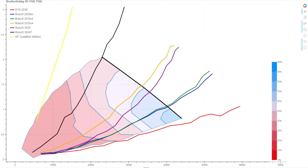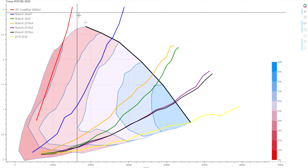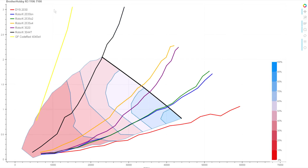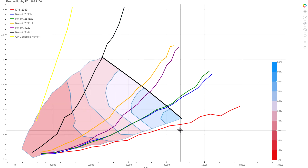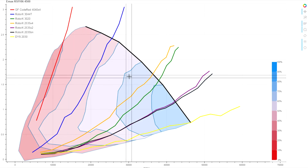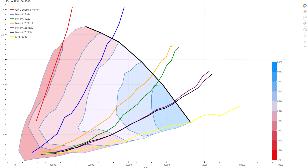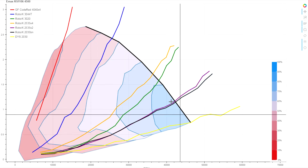This is the other thing we saw on the thrust stand — this motor is a little anemic in power. We're getting lower thrust out of basically all of these props compared to the 4500KV, which really should be pretty comparable.